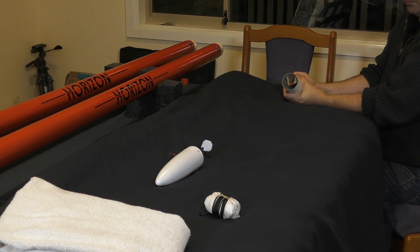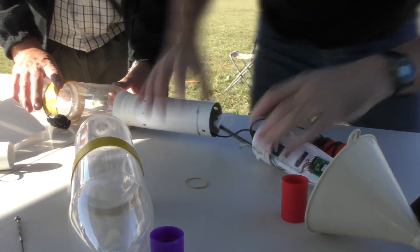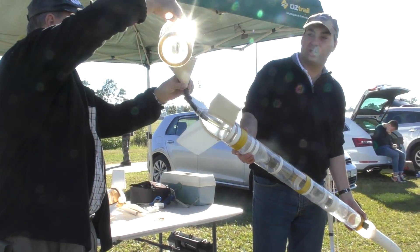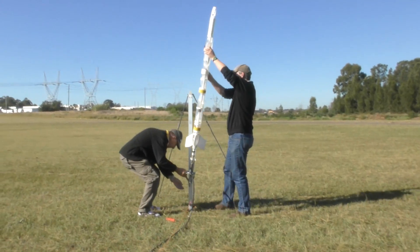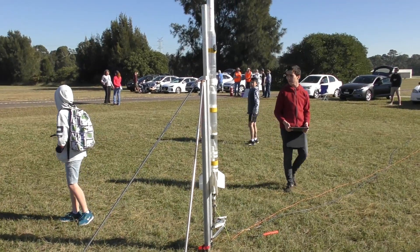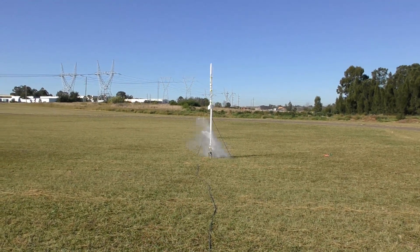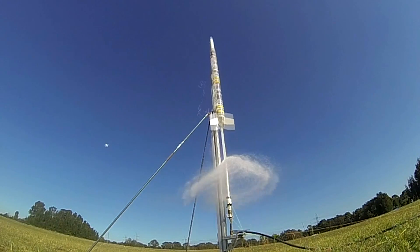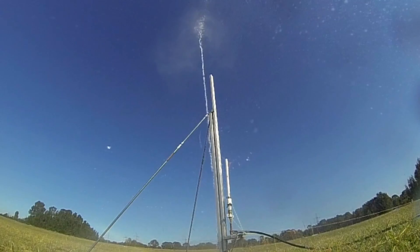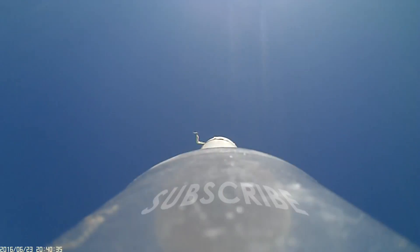Let's do some bench tests — we don't have the cord connected in these tests. You can see there's quite a bit of force to get the parachute to pop out. The next step was to do some flight testing. Before attaching it to the Horizon sustainer we wanted to do some lower altitude tests, so we attached it to the top of one of our regular rockets. For the first couple of launches we used a 21mm nozzle to try to get a little more acceleration to better simulate what the deployment mechanism will experience during the Horizon launch. This 25G acceleration is only about a quarter of what it will actually experience at the upper end of the design envelope.